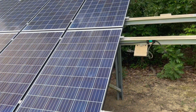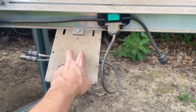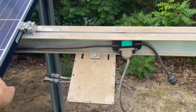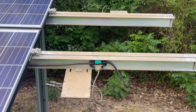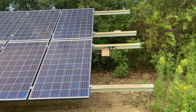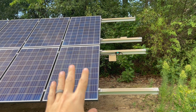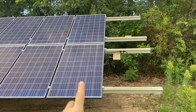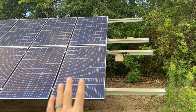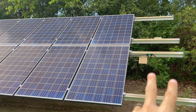What I'm going to do now is remove this piece and tuck this trunk line back up underneath on both those micro inverters so it cleans us up and they're not getting weathered. For now, I'll leave this with the clips and the inverters in hopes that I can find a couple of panels that match the right size with black frames. I can't get these anymore — maybe I can find some used ones on a secondhand scrap deal.